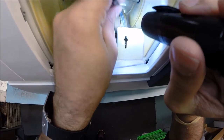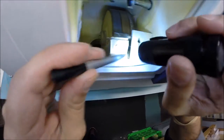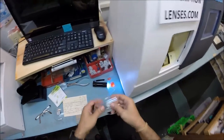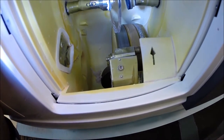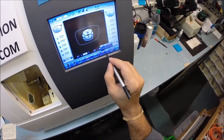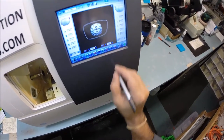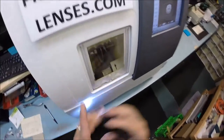This is the edger — it costs $40,000 and weighs 200 pounds. The actual cutting wheel on the far right acts like heavy-grit sandpaper to grind away your lens material. The center wheel flattens out any rough edges. There's also a little cutting blade that cuts a groove into your lens so it stays inside the monofilament string. I take your right lens and let the magnet hold it in place in the chuck. I wake up the computer — that is the shape of the lens I will cut.